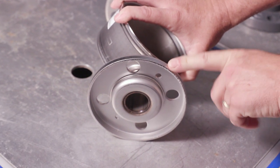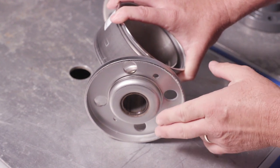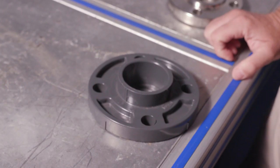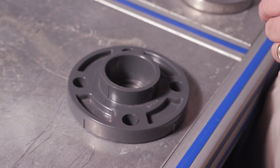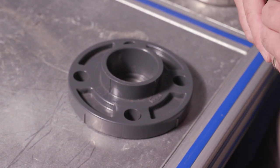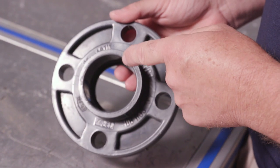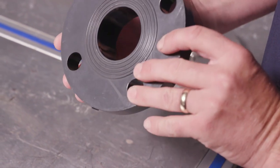This is 304 stainless, and the F is the ANSI round flange — a 300-pound ANSI flange. It does not come with the mating flange, so that would have to be purchased elsewhere. This is a four-bolt, inch-and-a-quarter, 300-pound flange. Let's look at a couple of flange examples. In this case we want a 300-pound, four-bolt, inch-and-a-quarter flange. Here's a two-inch slip fit schedule 80 flange — that would not be the right flange, just shown as an example.